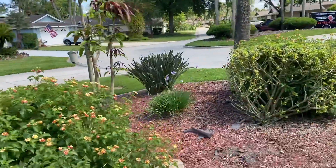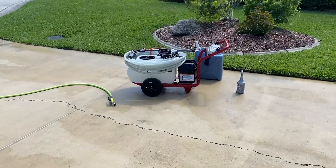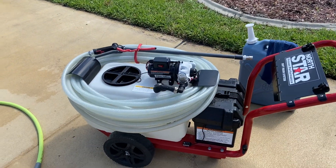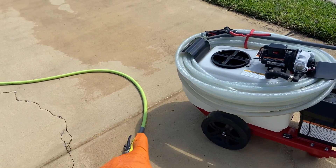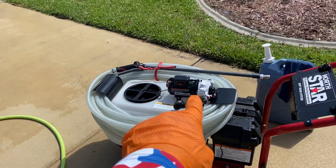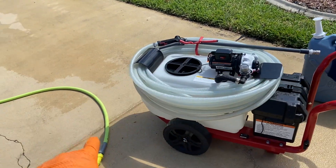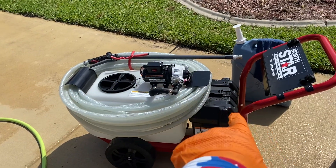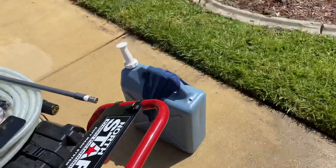I just wanted to show you guys that all you need — you can go to Northern Tool and pick one of these up for five or six hundred bucks. It's a 12-volt dedicated roof pump with a five-eighths poly braided siphon hose. You'll want to upgrade that though: get Flexzilla — not three-eighths, not half-inch, go for five-eighths. Upgrade the pump to a five-and-a-half gallon per minute, put 200 feet of soft wash hose — Flexzilla or the AG hose — and get a really good deep cycle marine battery.